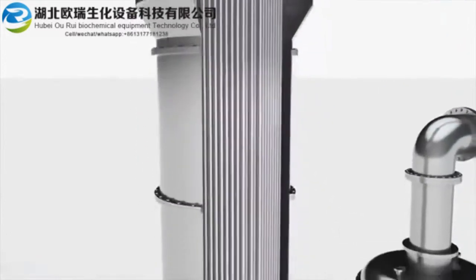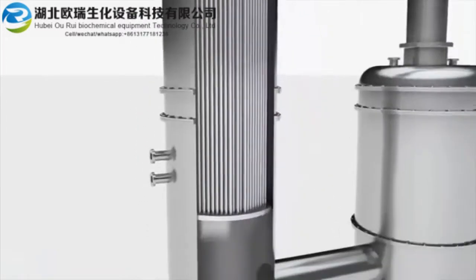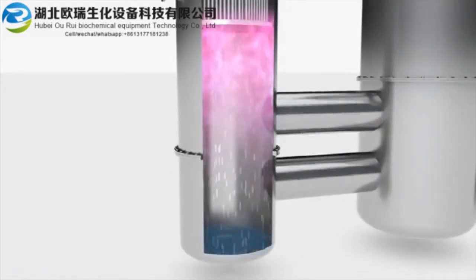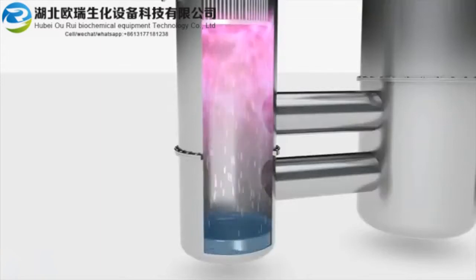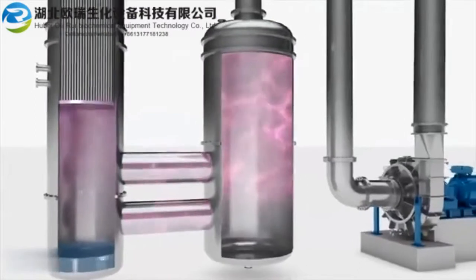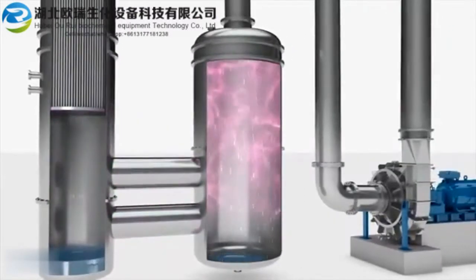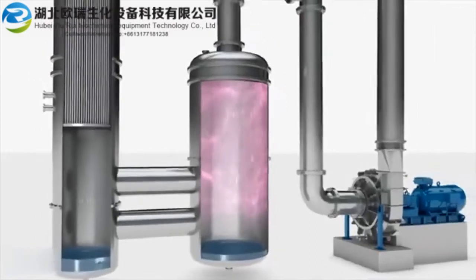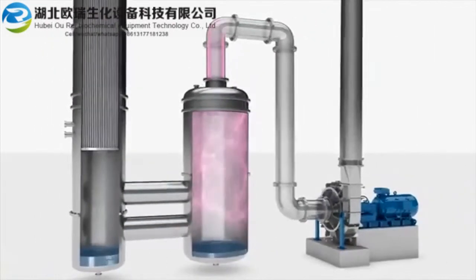The water which has been evaporated off leaves the tube as vapor. In the bottom section of the calandria, some of the concentrated liquid gathers and can be drawn off. The hot mixture passes into a cooler chamber called the separator, where more of the concentrated liquid falls to the bottom to be drawn off and the vapor rises to the top. This vapor now contains most of the energy that was initially fed into the system.